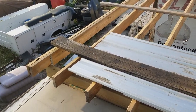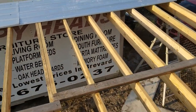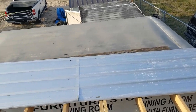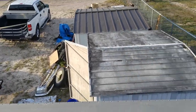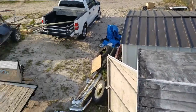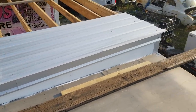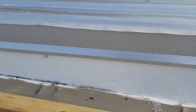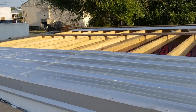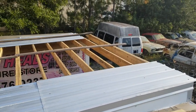We're up here on the roof and as you can see we're starting to get the roofing panels laid out. We're using metal roofing — this is actually all left over from a previous job on a house, so we're working with what we have. All the panels are cut slightly different lengths, but we're trying to lay them out so we have enough to finish the entire roof. The first two panels are just held on with a couple screws. We've finished one side, getting it sealed down to the top of the first pod. That's a piece of three-quarter pressure treated plywood, sealed all the way down the edge to the top of the ceiling, and then it was just painted white to help it blend in a little better.